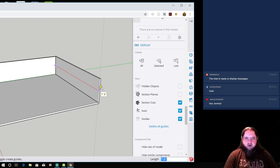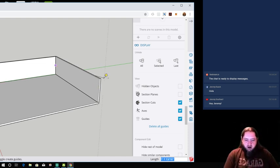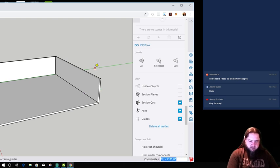The width he gave me was 17.75 inches. So I'm going to actually work towards 17 inches. And that'll give some wiggle room on the sides too. Let's see. The drawer is supposed to be 4.5 inches tall. So that's 4 1/4, just to make sure there's some clearance. And it is 19 inches long. So let me not move, use the hand tool here.